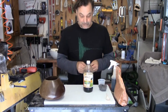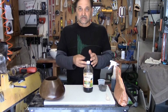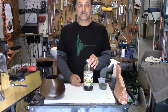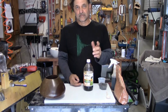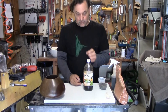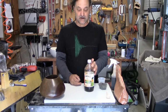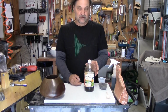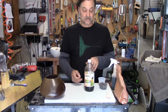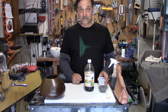What's the purpose of the hole in the top? I think just to allow the off gases. It's not a lot, but it's enough that you should have a way for the gases and air to escape. And then once you have this, just leave it for a week or two, and that will usually be the amount of time it takes for all of or most of the steel wool to dissolve in it, to get it up to that iron acetate solution that you need.